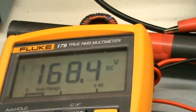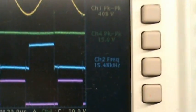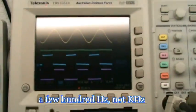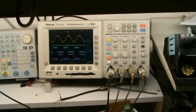There should be something here. And then it's not exactly in resonance, so we have a difference of a few hundred kilohertz there, I think, which probably could be one of the reasons that the PLL did not work or something.